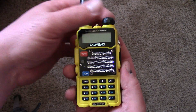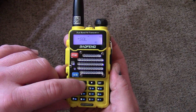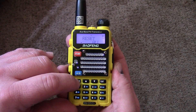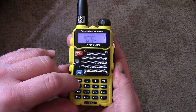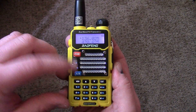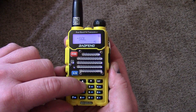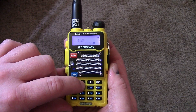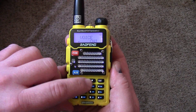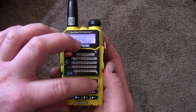First thing I like to do when I get it out of the box: turn it on, hit Menu, and go down to Menu 40, which is the reset. We just want to wipe the memory. Hit Menu a couple of times until it says 'Please Wait' and we've got a nice fresh radio. You'll notice we're now in Chinese, so scroll up or use the keypad and go to Menu 14 — that's the voice language setting. Hit Menu and select English.